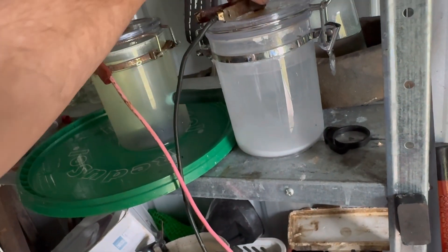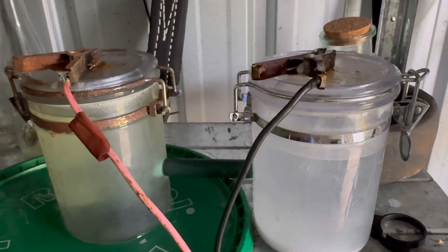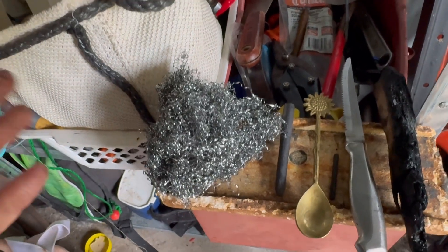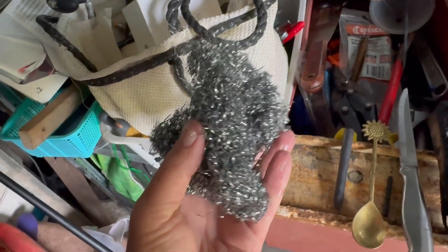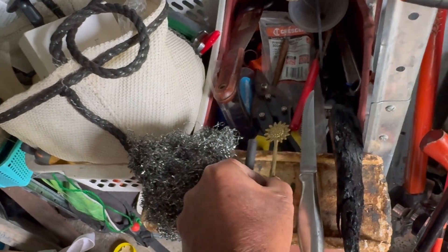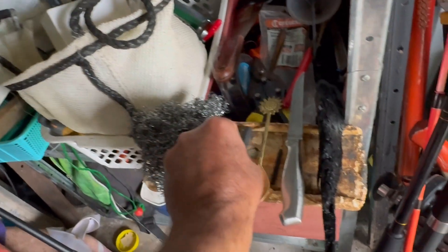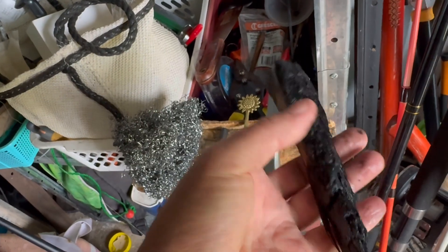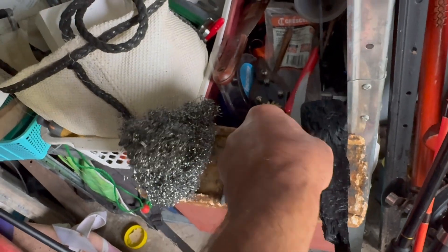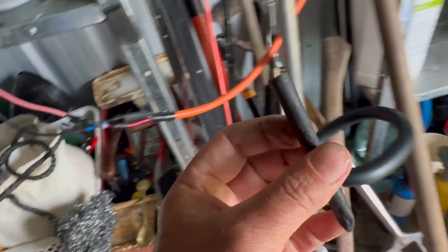I hope that helps people, especially if you're looking at doing a setup like this at home. It's a good idea to know exactly what type of electrodes you should be using and what to avoid. As tempting as it is — avoid stainless steel, avoid brass and nickel, and stick to your carbon electrodes in any form you can get: charcoal, graphite, or purpose-made carbon rods.